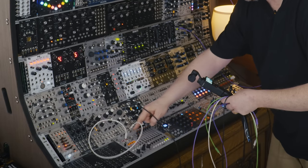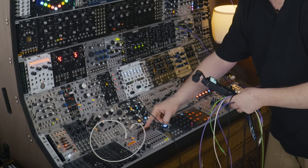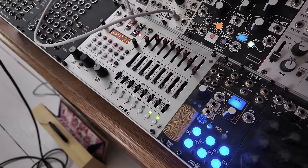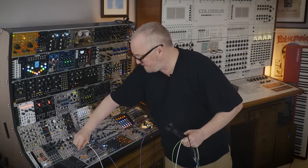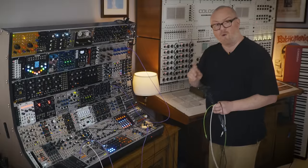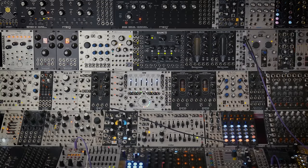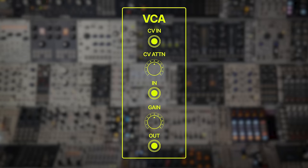That's pleasant, isn't it? But we can change the values. You'll see that it's basically creating different voltages. It's still always on, and that is because the oscillator is connected directly to the speakers. We need to put something in its way — an amplifier, or more specifically, a voltage controlled amplifier.